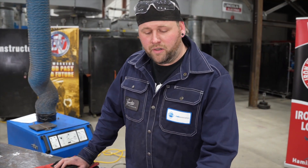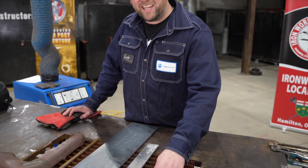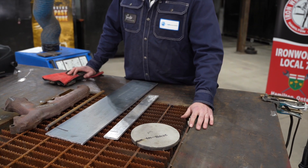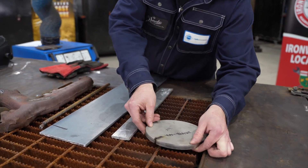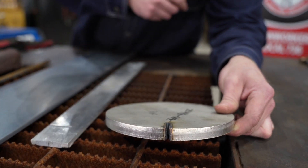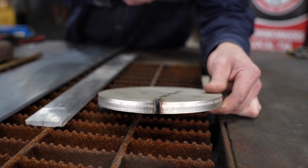These last two materials here, aluminum and stainless, you would not be able to cut with oxyacetylene. I just want you to notice when we talk about the belling effect that it gets wider as it gets to the bottom. So on heavier material, you'll experience that.